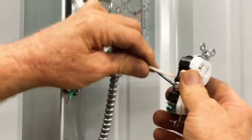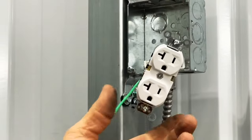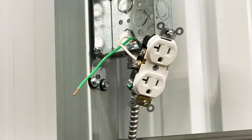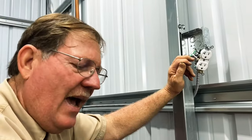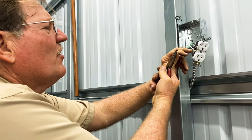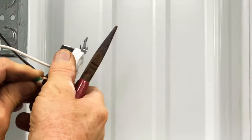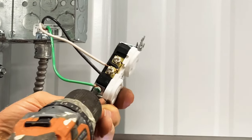Now to do the back side — bring it around. This is 20 amp; you don't want to use 15 only for houses because I got a lot of equipment in this. Now this is tight. Your last one — so this is a 20 amp. The gauges of wire: these are 12. In a house you can go with number 14 but it will not work with a 20 amp breaker — too much amperage, it'll melt the wire. Take your little needle nose, you see that little hook — you want to put that little hook in there because you're going to hook right here behind that green ground. See how it wraps it? It continues to spin as you're tightening it up clockwise. See how that tightens it up — it continues to tighten it.